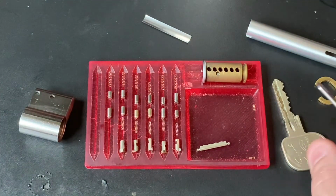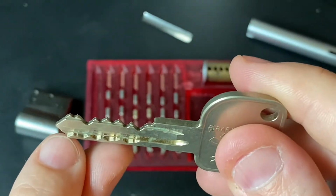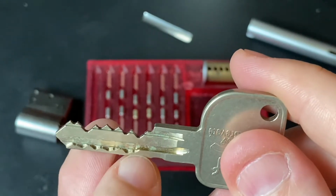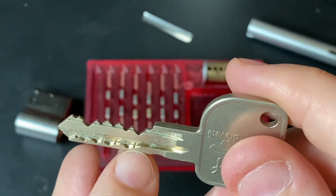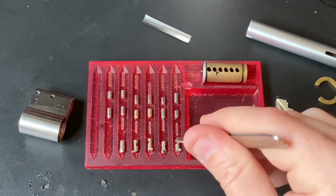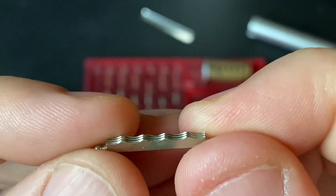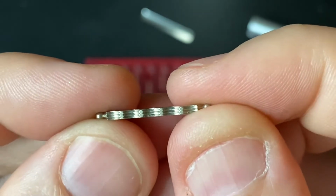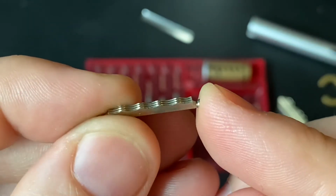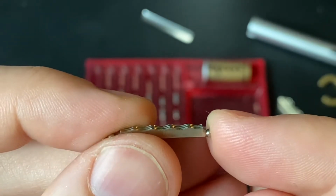The way that that functions with the key is you can see that the key looks like there's not five spots here, there's 10. And so the nub will interact with one of these, but you don't know which one unless you know the pinning of the lock. The little serrations on those side pins interact with the sidebar, which you can see is also serrated, and it looks like waves. I don't know if that's why they called it a surf, but I hope so, because that's pretty cool. So yeah, kind of a unique little sidebar here